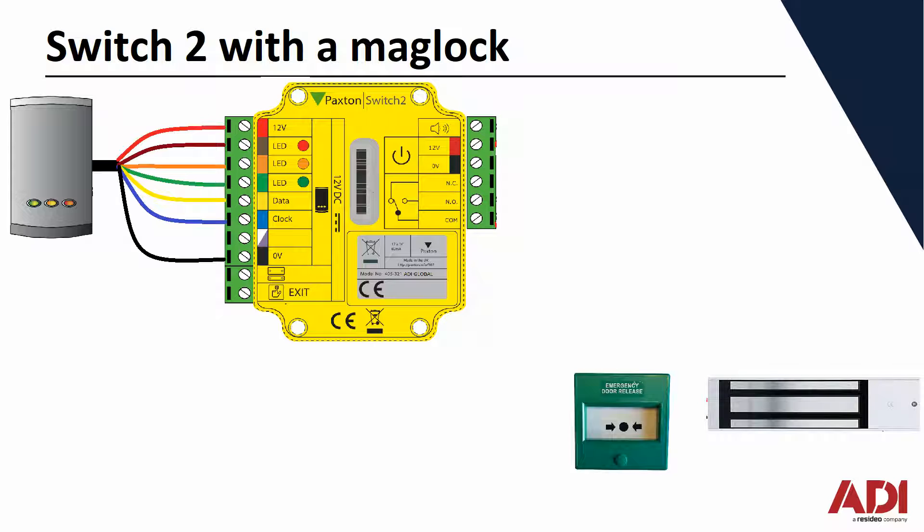With the items in place, let's look at the wiring. A mag lock is fail safe, which means if the power fails the device will unlock. We need to give constant power to the magnet and we're going to use the relay to do that. If you're not familiar with fail safe, fail secure, or how a relay works, I'll put two links in the description box so you can look those up.